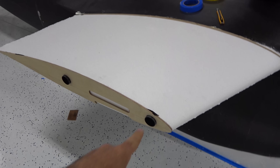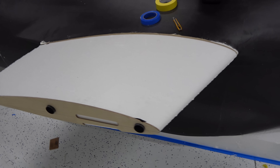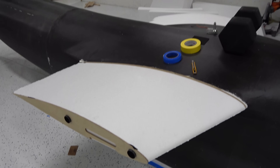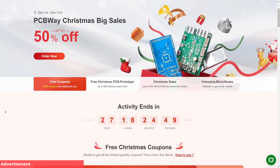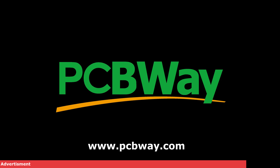The tubes are glued with the ribs, both of them, and I glued this on a flat table, so there is no twist whatsoever between the wings — they are perfectly squared. This is how far the tubes are going to go, and I'll maybe put just a tube for extra strength, but the skin will be like a sandwich material so it would be strong enough. Now that I know this is perfect, I can basically glue these on the rest of the wing. This video is sponsored by PCBWay. PCBWay offers custom PCB board type service, CNC machining, 3D printing, injection molding, and more. At this time of year for Christmas, you can get discounts up to 50%, free Christmas coupons up to $200, and free Christmas patches. Check them out at pcbway.com.